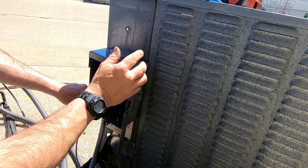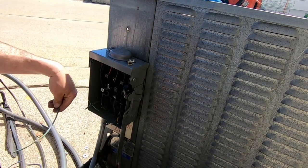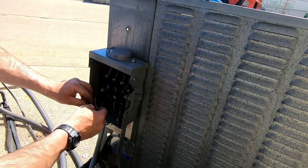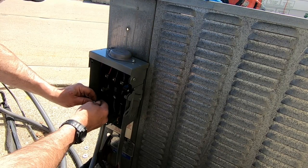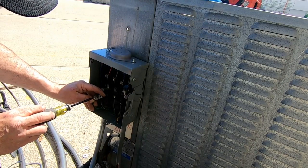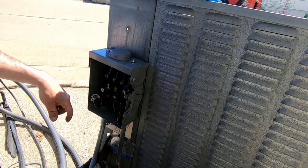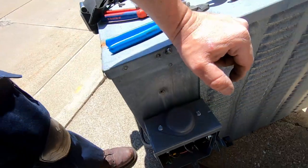When in doubt, take a ground out of the other one. You would think they would have bonded it — just an extra safety precaution. I guess it wasn't that important. We're going to junction here on this lug and then secure it to the box. It's obviously inside the unit grounded to the chassis, but I prefer to have it out here at the box too as extra protection. I think it comes down to cost honestly. Got all the wiring taken care of, wire-nutted back together, good to go. Put the cover back on.